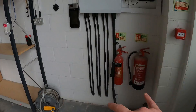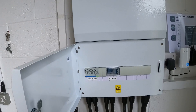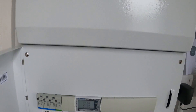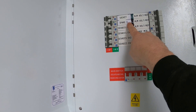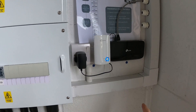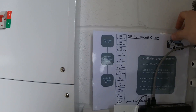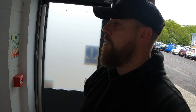Before I do the handover, I'll just bring you in and show you the panel board we've installed. All our EV circuits are coming in there, and this is the Luden panel board. In the bottom half we've got our surge device and our ALM meter, which is currently monitoring the voltage on all phases. In the top half we've got all our Servalus charger breakers, a spare one for the future, a socket powering up this gear, some ALM voltage references, and the surge MCB. Over here we've got a chart showing the installation characteristics for any other sparkies that might end up working on it — where all the cables go, where it's isolated from, etc.